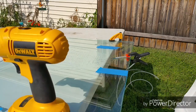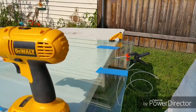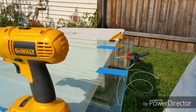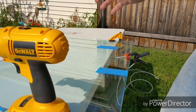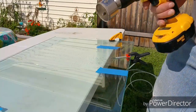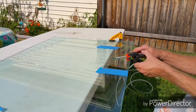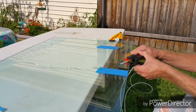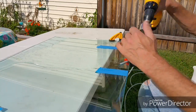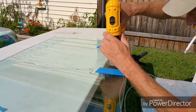If you've never drilled glass before, a lot of these kits — like Glass Holes, which I love the name of their company — they'll sell you the overflow, the hole saw, the bulkheads, and they'll even sell you a template that you can clamp on here and it'll keep the drill bit right where you want it. I know I usually don't use one, and sometimes I get a little dancing around in the beginning, but once you cut a groove you pretty much have a template. I start on a slight angle.